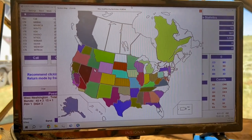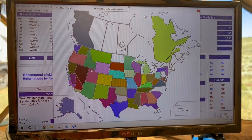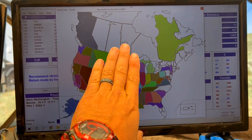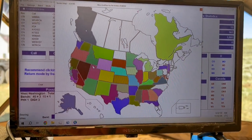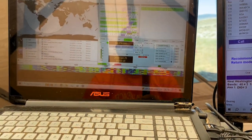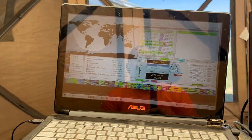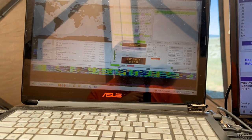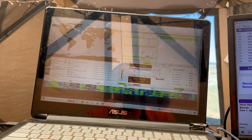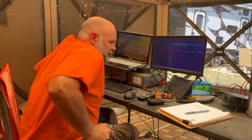There's a look at the contact map after yesterday's activation. Not too bad — I didn't think I'd be getting out to those eastern states. But there was more room on 20 meters than I thought there would be on FT8, which facilitated all these contacts east of the Mississippi. I'm hopping around a ton — if I've called three, four, or five times and haven't gotten a response, I flip to the other side of the band and go to a space I know is open. FT4 has actually been kind of a bust early on this morning. I say FT8 but I include all digital modes.